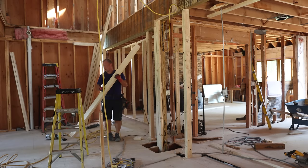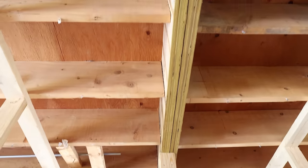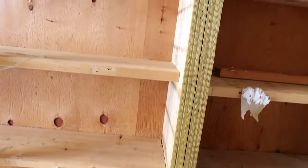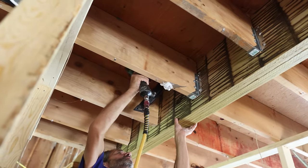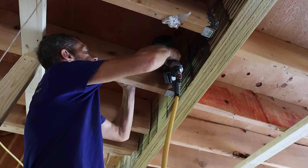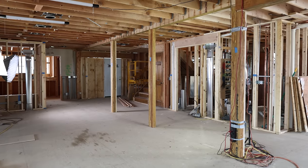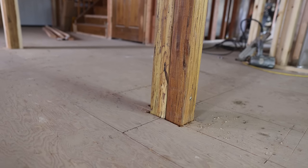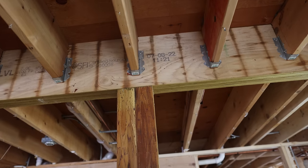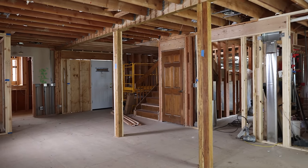The other option on the table was to go with a steel beam across the entire span, but that created its own logistical and financial challenges I was not ready to undertake. We would have had to put additional supports in the basement involving cutting into the slab and putting in column supports. So LVL beams and PSL posts we went with, and honestly I think it turned out great. Once everything is wrapped with faux beams it's going to create an architectural feature we weren't expecting but will make this house unique and give it a little more character.